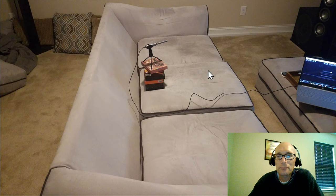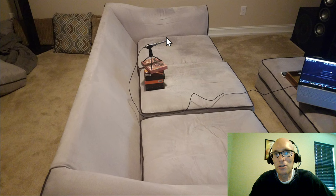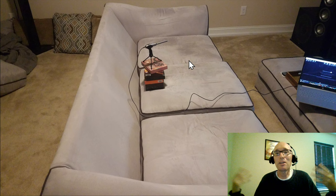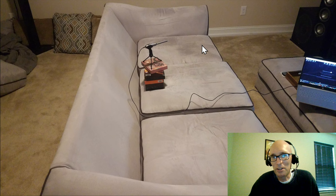I just thought, hey, I'm gonna try measuring it this way this time. And I felt it gave really good results. Now, the only downside to this is you have to measure your subwoofer in a different way. You can't measure your subwoofer like this, because sub sound is really coming and bouncing from everywhere to get to your listening position. So pointing this directly at a subwoofer to measure it is not a good idea, and I wouldn't advise that. This is why I calibrate my subwoofer separately. Whenever I do anything, I always calibrate my subwoofers separately. Never really do them in the same measurement. You can.